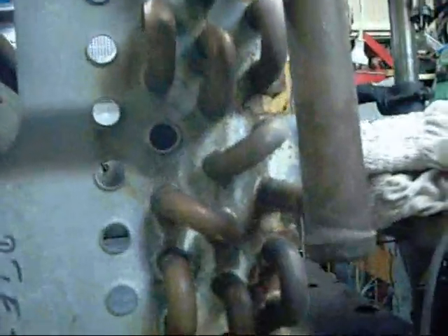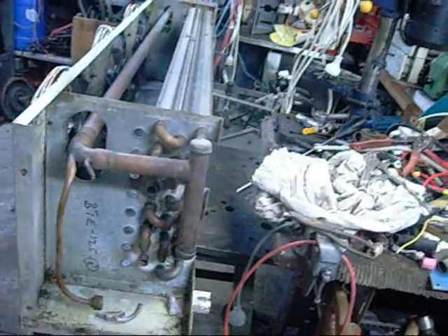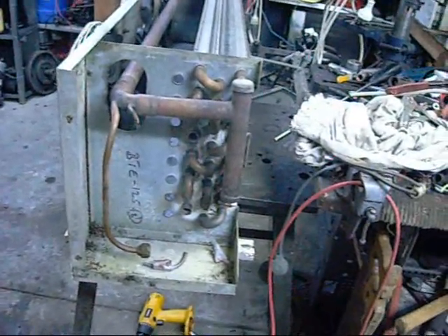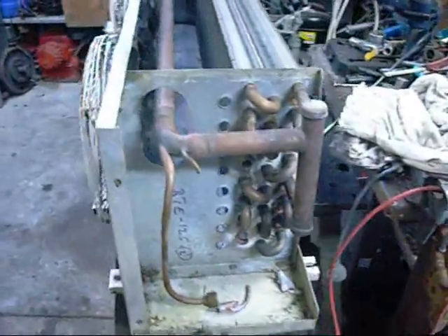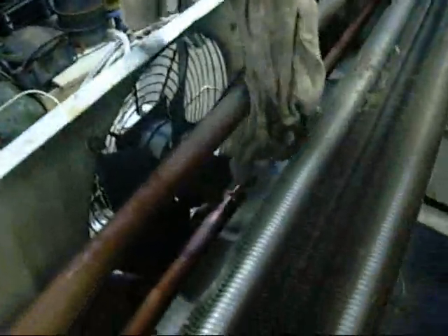The end plate got a bit hot, it smoked a bit. Clean that up and either silver solder or lead solder them in, just make a new manifold like that one. Solder that shut - that's a liquid dump from the TX valve, that's no use. Try and wash it out with some petrol for starters, then a lot of compressed air - just blow air through it, try and get rid of that oil. I don't want oil in the hydronic system. Slowly getting there. Drilled a few holes in the casing and ran a new tube through - actually soldered two pieces together with a joiner. Just get rid of the flux residue - leave that on there and it just turns it into green oxide.